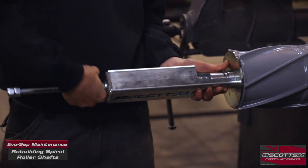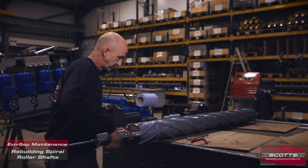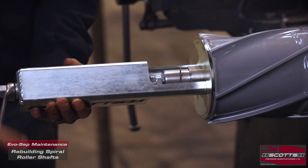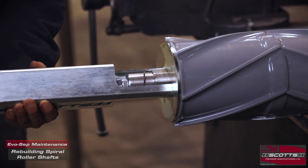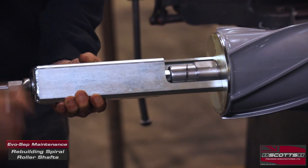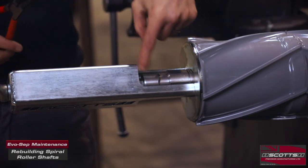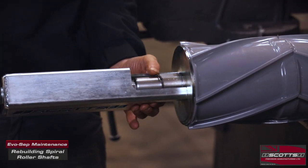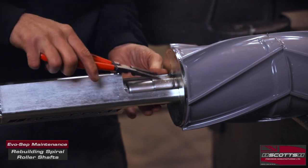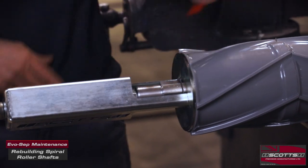As you can see, you can get a little bit of the way by hand, but ultimately to get that full pressure on, do it with the ring end this time because it stays on better. Wind that round and we should then come past the circlip groove. You can see there's quite a bit of compression just to get us there. Now we've exposed it, so we're all good. You can see why we cut the piece out of the tool — so we can get the circlip pliers in. Circlip pliers go straight onto the circlip; try not to overstretch it. Slide that up — you can always just tap the last bit on with the circlip pliers. Sat nicely in there.